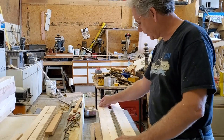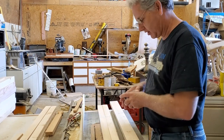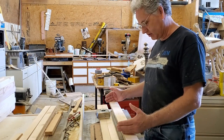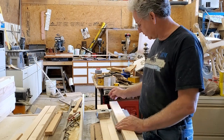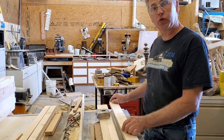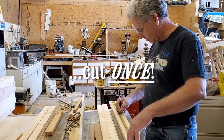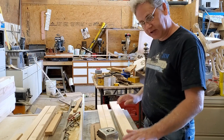Now we need to do a little bit of figuring. These are my two stiles on the outside edge — you can see we've got the mortises in them. I lay them side by side to check that they total three inches. My total outside dimensions on the panel are 16 inches, so I subtract three, which gives 13 inches. But I have to account for the quarter-inch tenon on each side, so I go from 16 inches to 13 inches to 13 and a half inches. I'm going to measure out 13 and a half and cut three of them on the chop saw.